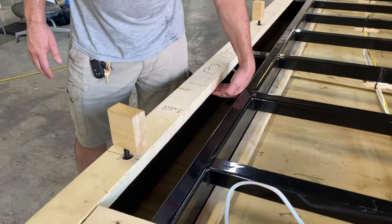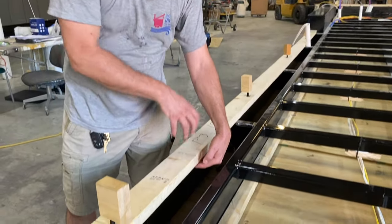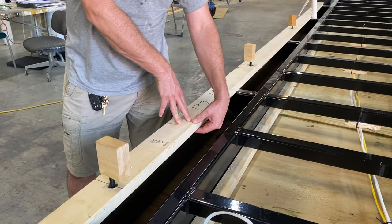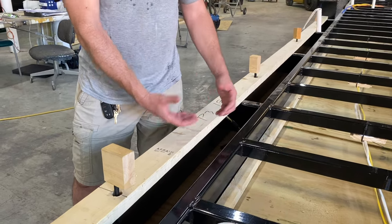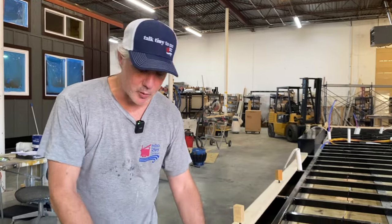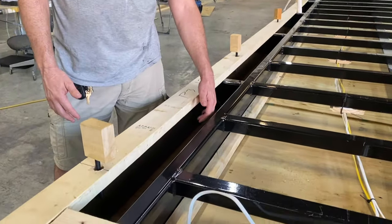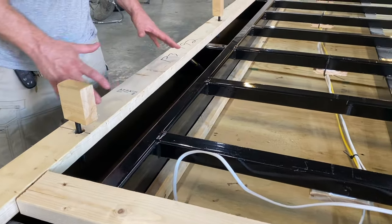because some of the trailer designs that we were using in the past had a flat bar here, and you had to drill through it and bolt your bottom plate of your framing down to that bottom plate, but it had no insulation there. So in the wintertime, some of our customers were getting condensation down around their baseboards. So we decided to go with this outrigger design, which a lot of other trailer manufacturers use as well. But this can be insulated, so that eliminates that issue.